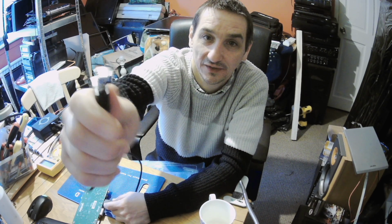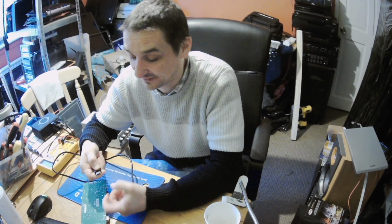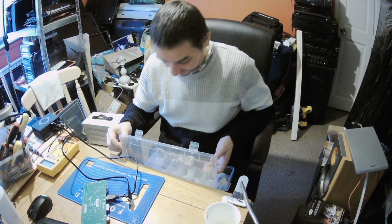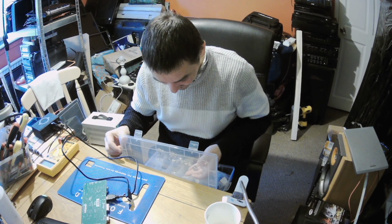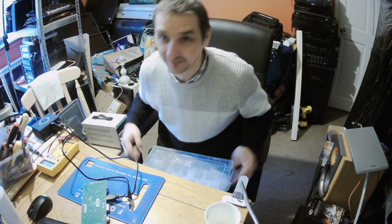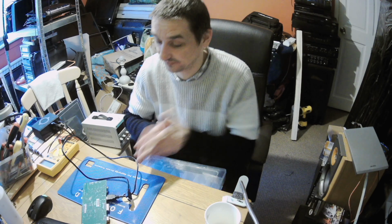Because I did put one HDMI port on it and I've tested pin by pin, I know it's not an issue, and I've tested the filters and it's not an issue. I wouldn't say it's beneficial for the customer to get a large payment for the processor swap. So I'm waiting on the customer to reply. I'll put it back together.